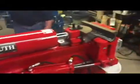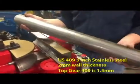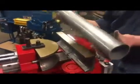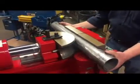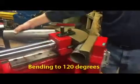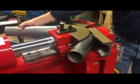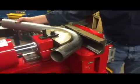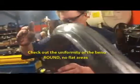Now we'll bend some material. First, we're going to bend one of the harder materials: 409 three-inch stainless steel. It comes in a two-millimeter wall thickness, so it's very heavy — it takes power to move this stainless steel. We're going to load it in the machine and bend it to about 120 degrees. What we're going to be looking for is a nice uniform bend and roundness on the OD, or the outside of the bend. You can see how nice and round this is.